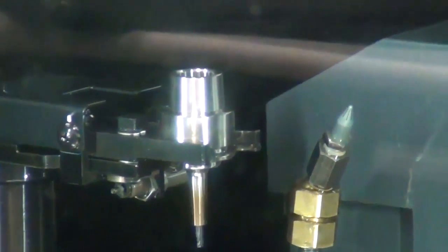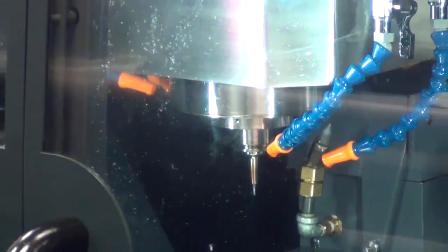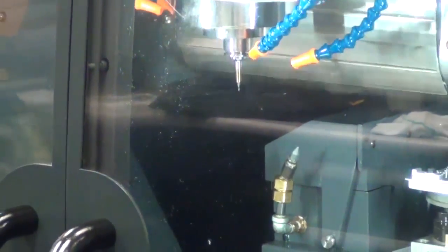An interesting project came up with a very tight tolerance requirement. We were making a mask that had two features that had to be aligned nearly four inches apart at a true position of two ten-thousandths of an inch — meaning you needed to be less than seventy millionths of an inch off on an XY graph to be in tolerance. This is the only piece of equipment I'm aware of that I would even entertain doing that on.